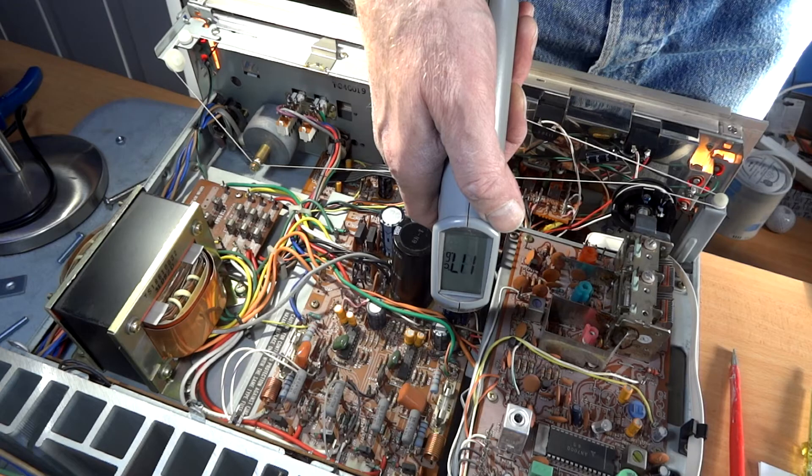Let's bring up a reading now. Don't forget the first 3 watt resistor read 127 degrees. Here's a picture of the 5 watt resistor, and as you can see this now measures 117 degrees Celsius - bringing it down 10 degrees, and well within the 150-155 degree operating temperature. So the resistor would be fine. Like I said, I also bought a 10 watt ceramic resistor, and I thought let's take this one out and stick the 10 watt one in. These 10 watt resistors are quite big - much bigger than the 3 watt, and noticeably bigger than the 5 watt too.